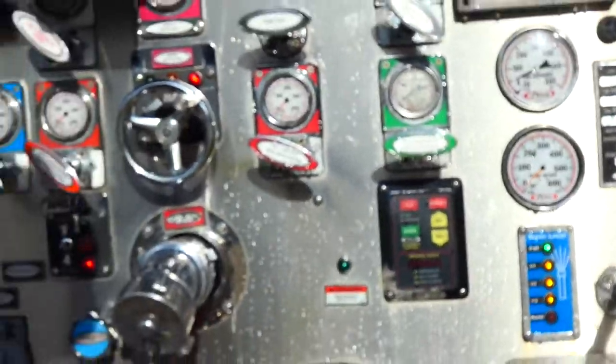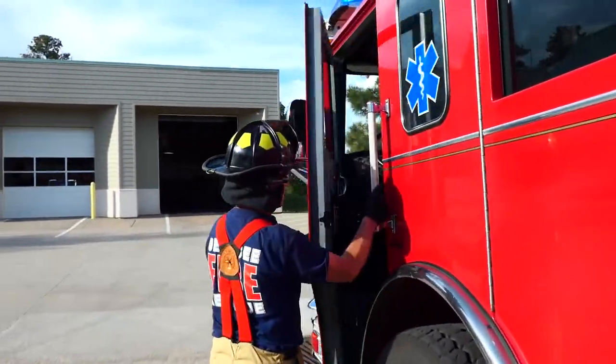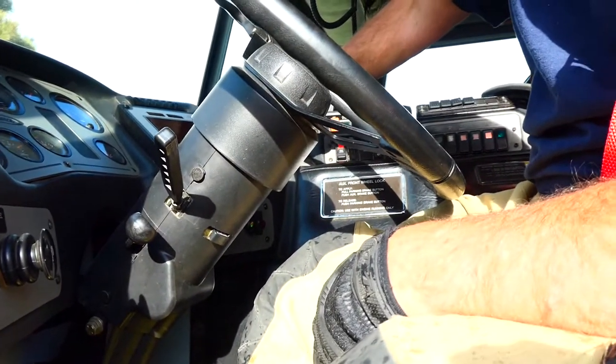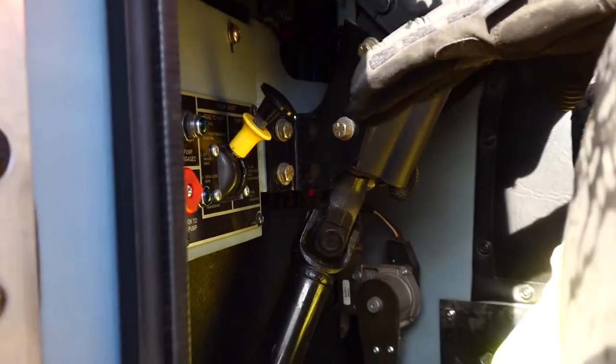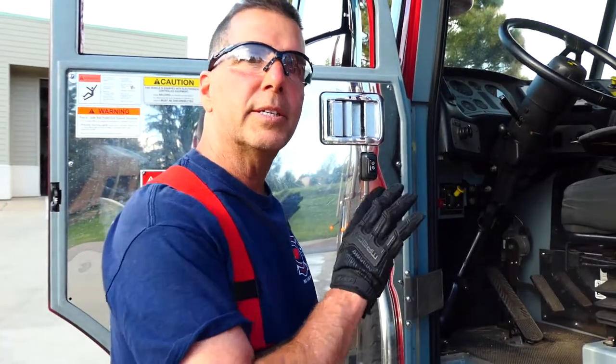Now I'm going to turn this down — close off the hydrant. If I was sitting idle for a long time, I could open my recirc valve to keep the engine cool. Closing the hydrant — red, yellow — and we go to red. We're totally closed. You can see our pump intake just dropped down to zero as far as our hydrant supply. Going to shut it off in the cab. Put my foot on the brake, take it out of drive, put it back into neutral — if I don't do that I'm going to shear the gears. Engine goes down to slow idle. Bring it to the middle position, wait two seconds, bring it into the upper position. We are now having the engine engage the rear tires. We have now completed pumping 971.